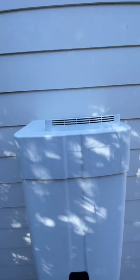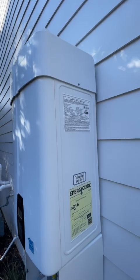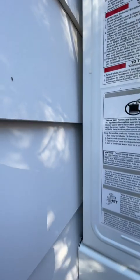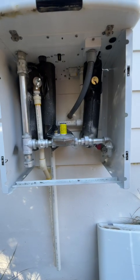And I just look for damage, clogging, rust, corrosion, water leaks. It's mounted securely. It's got a metal bracket secured to the house, the siding. Hopefully it goes into the studs. And there's some separation there with those little pegs to give it some clearance between the unit itself and the house, according to the manufacturer's installation manual. And the components that you can easily see underneath, the pipes.